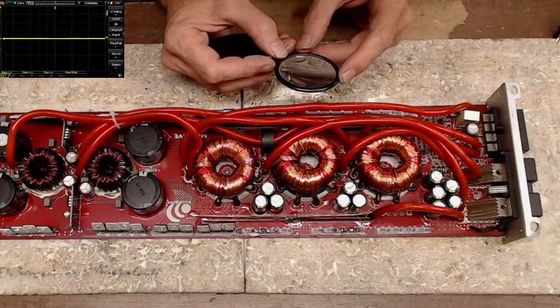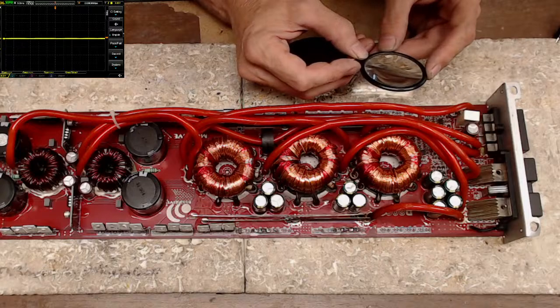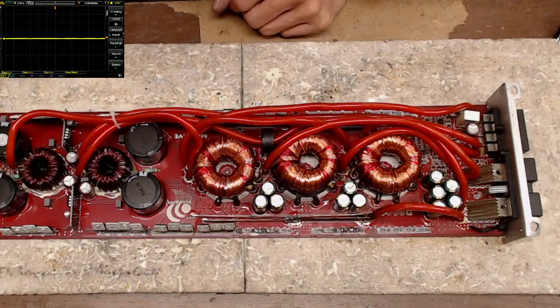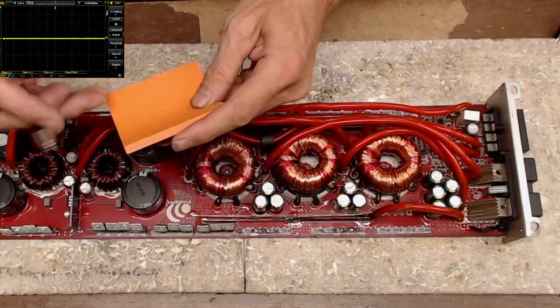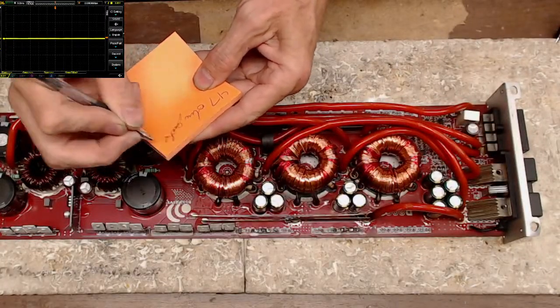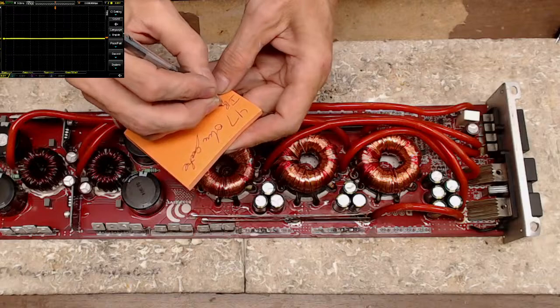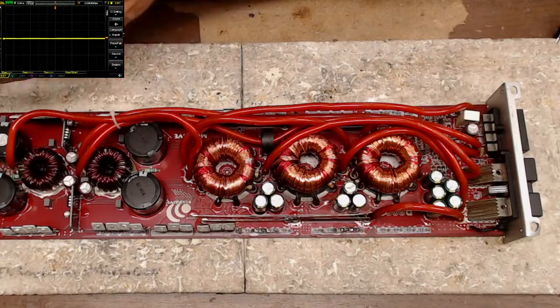Of course, all the gate resistors are cooked to a point that I can't... Oh yeah, 47 ohm gate resistors. So what I do then is I just make my little note here, 47 ohm gate resistors. And these were the IRF1018Es for the transistors, which I'll have to pull the data sheet up and see how close they are in values to the 3205s.